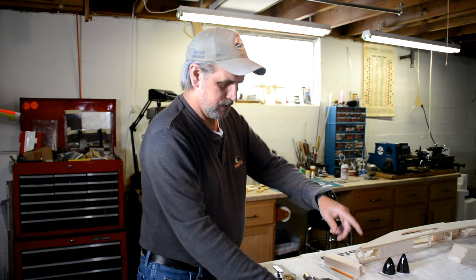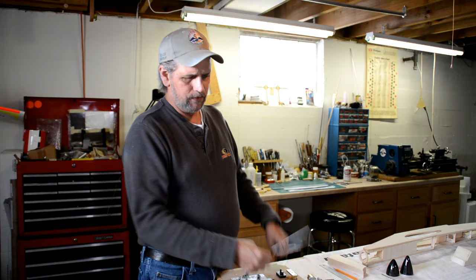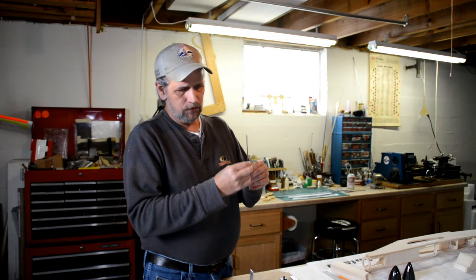Did you make any 3/32nds? I haven't made any 3/32nds yet. I have the materials, but I haven't made any yet. The only difference in this and a 3/32, these are 1/8 inch drill rod blank, and I got 3/32nds drill rod blank. The only difference is when I make these horns, I drill a different size hole because there's a set clearance that you want. It's not super tight, but it's loose enough that allows the silver solder to penetrate.